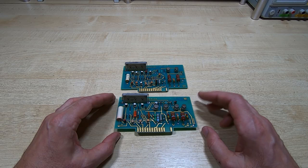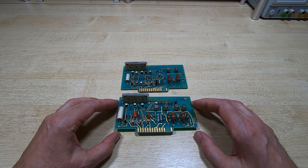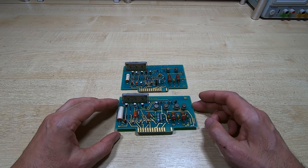And so while I was going through the power supply, I did find an issue. You will have noticed that in the earlier videos there was some distortion on the display, and the display is synchronized to the mains frequency, so it won't have been due to any distortion through the mains other than fixed distortion, which should have been taken care of within the overall behavior of the scanning circuits.